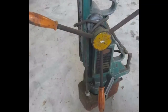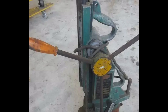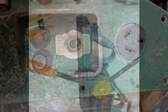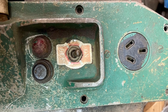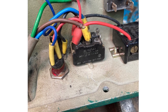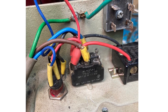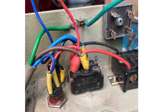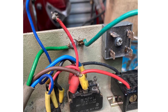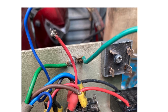Just before Christmas I was looking on eBay and found something I didn't know I needed — this is a magnetic base drill stand. That big drill is just so perfect to go on this, so that's why I bought it. It was a bit rough, and when I plugged it in it tripped the circuit breaker. I thought I'd bought a dud. So I started testing by putting a multimeter on the coil and got an ohms reading, which was very encouraging — a reading of one or no change would have meant the magnetic coil internally was broken, and a zero would have meant a dead short. So having an ohms reading really gave me some hope. I then connected an AC lead straight to the bridge rectifier and connected the other side to the magnet — the magnet gave out a lovely hum and I couldn't budge it, so the bridge rectifier and magnet were all good. The problem was in the dodgy wiring somewhere.